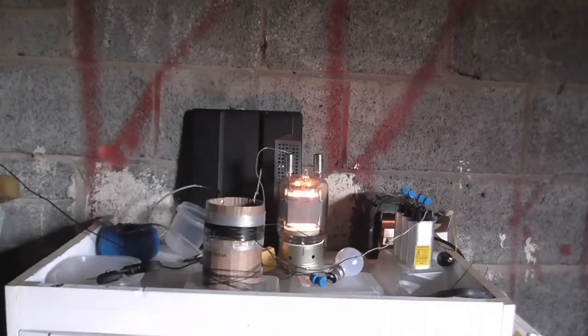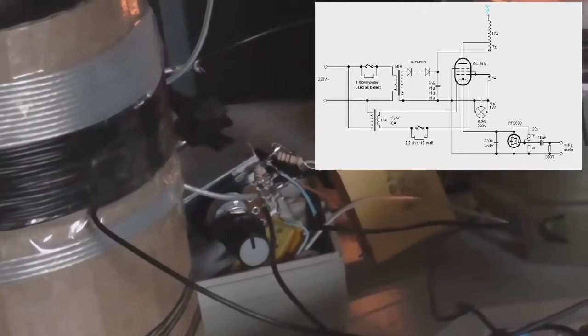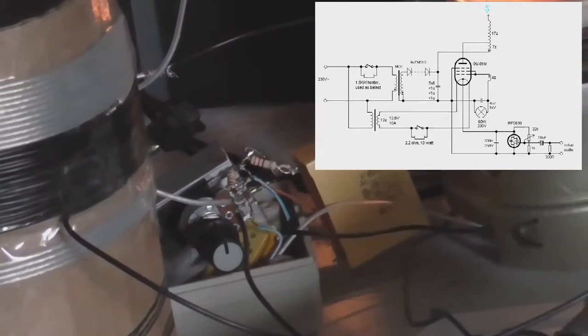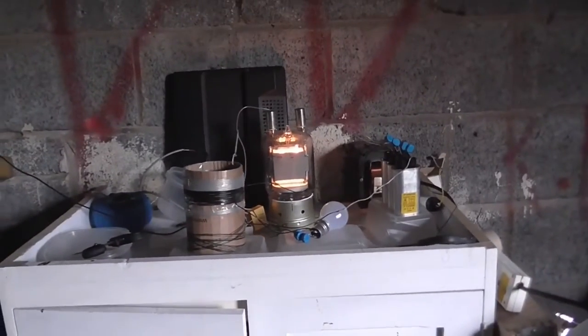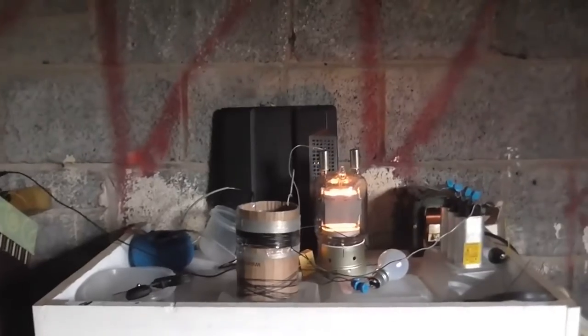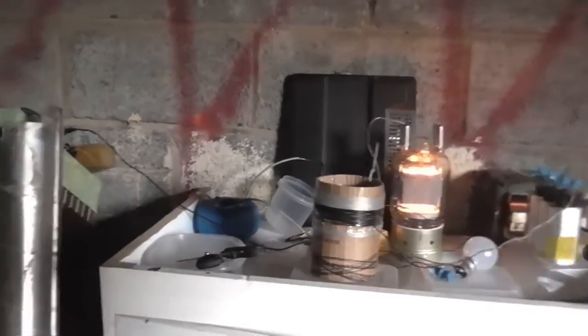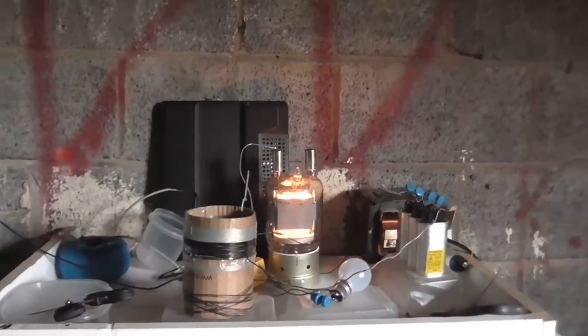Trying to do audio modulation now, but alas, I got nothing. I've got this little circuit here with a MOSFET in it. You might be able to see that. And this is the same circuit that Danny K thingy, whatever his name is, did. The only difference is I'm using an IRFP260 instead of an IRFP630. And I got nothing. Let's connect that up to this Walkman over here, which is set to a volume on about halfway. And no matter where I set this potentiometer, the spark length is always the same, and there is no audio.